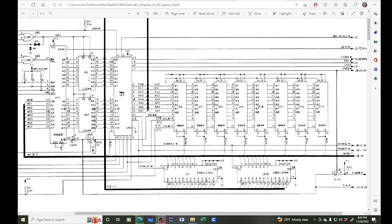So it looks like we've got our memory addresses here, split between these two buffers, and then you come into the memory manager unit, and then there's an 8-bit bus coming into each of these 1-bit chips, and then you see the 1-bit then coming out here. So we should be able to see, if we connect on here, the addressing happening. But first, let's just see if the signals coming into these memory chips look like decent signals.